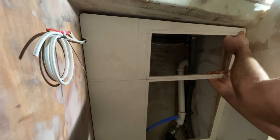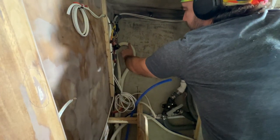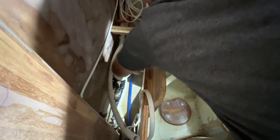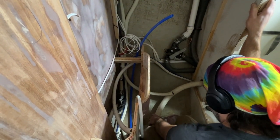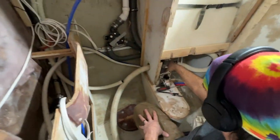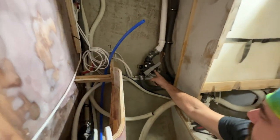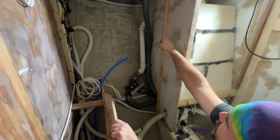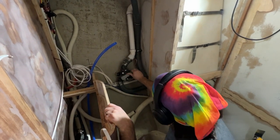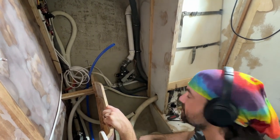The water goes up well above the waterline — which sits right about here — with that tiny little plug letting just a tiny bit of air in. Then that goes down through this hole into the tray here which will supply the toilet. Then it'll go through the toilet along with some bad stuff, and that will go up through this manual pump, around the corner into an electric pump, and then pop out here to where it will either go up into the holding tank or straight into the ocean. We have both options — one valve allows flow this way and one allows flow that way.